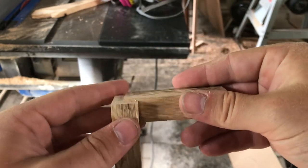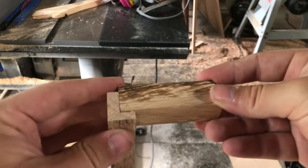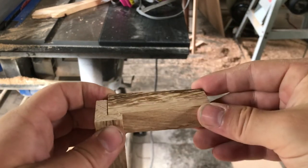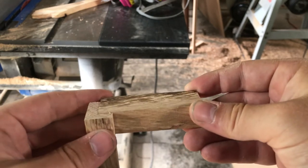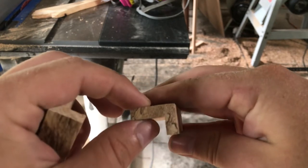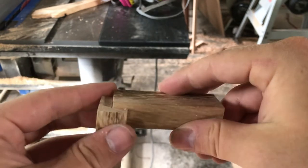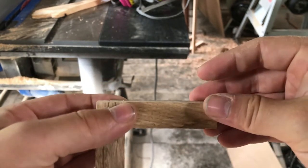And what that'll do is allow this, which would be the rail, the horizontal piece, or the width of your frame, to stay full length, and it just lets this one tuck just a little bit extra. And that's why in this case I added 5/8 of an inch. It's because this space here is about 5/16. And so you double that, so it's one on top, one on bottom. And that means that the dimensions should still all work out.